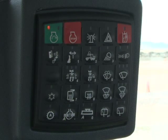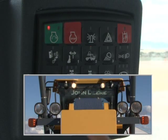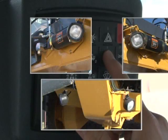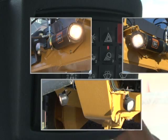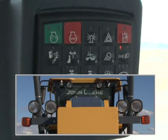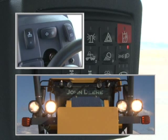To the right is the front work light switch — if equipped, the two front lights illuminate. The next switch illuminates the lights on each side of the frame and the lower lights if equipped. To the far right is the drive light switch: the marker lights illuminate with one press, and a second press with two LEDs illuminated turns on the headlights. The bright/dim switch is located on the front console.